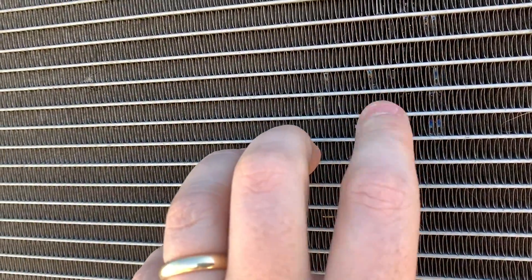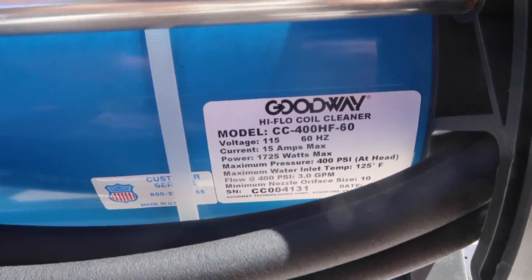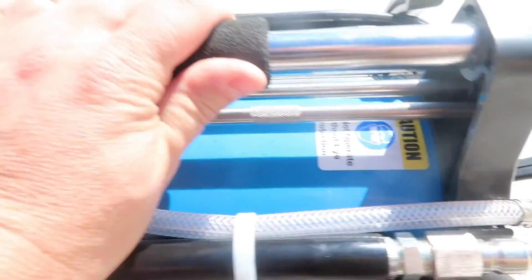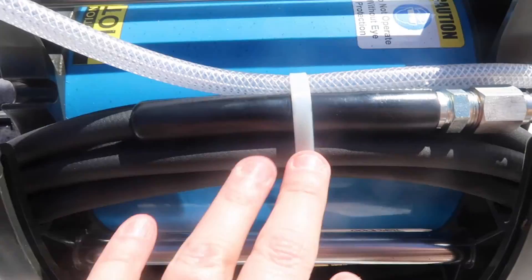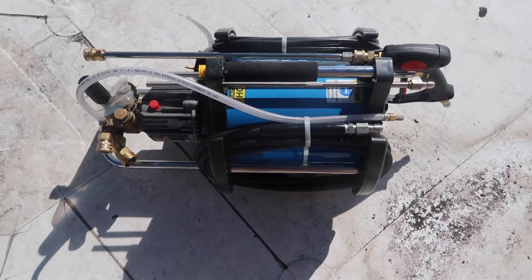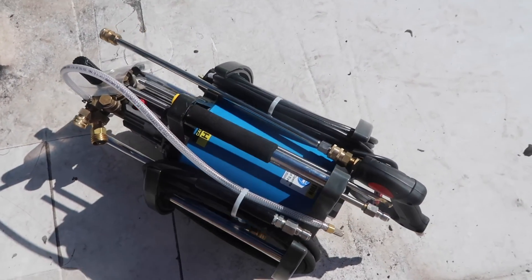It's just like a car radiator. And if any of these get nicked, damaged, or corroded, you've got a big oil spot and an ugly situation. So we're going to be working with the high flow coil cleaner from Goodway. We've got a microchannel coil that we definitely cannot hit with too much pressure. We're going to use a very, very mild cleaner on this, but it needs to be cleaned. This is a grocery store application, so we're going to demonstrate this here.